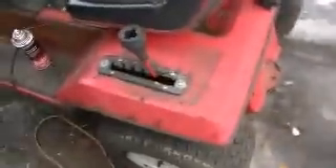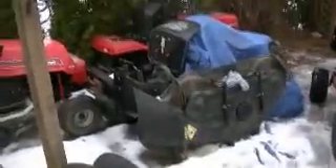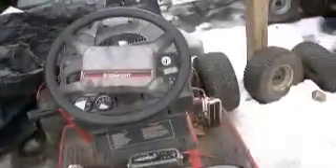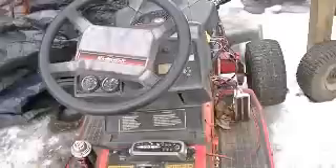The Red Rocket is back on all fours and I've actually driven it — I drove it yesterday for the first time. I tried on Thursday but couldn't get it to stay running; turned out I had two bad spark plugs. I'll replace them with the brand new ones. It's fast with no belt slippage. Unfortunately, I lost first, second, and third gears — this plastic shift piece is really starting to break. I've got to find a new one, maybe off one of the other tractors. Also, I forgot to hook up the brake lever when I had the fenders off, so I need to reach under and connect that.